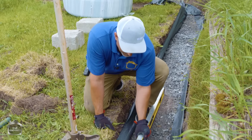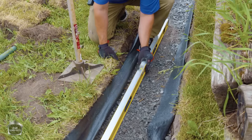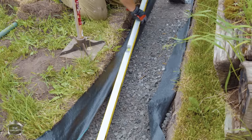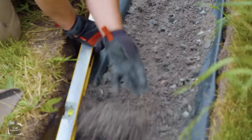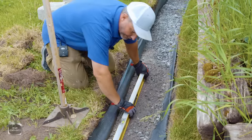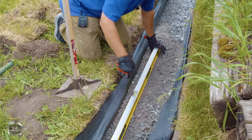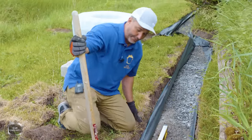What I want to do with my first course is get my first three bricks level. I've got too much stone here. I'm just going to add a couple shovels of dirt and use the hand tamper.